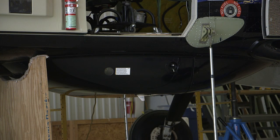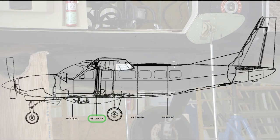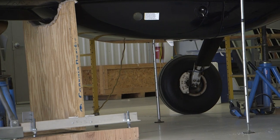Though other methods may be used, this video focuses on one acceptable method for shoring. Locate the shoring cradles at fuselage stations 234 and 284 per Chapter 7 of the maintenance manual. Since the blister pod interferes with the cradle location at fuselage station 166.45, it is permissible to support the fuselage at this station utilizing the lower wing strut to fuselage attach fittings.